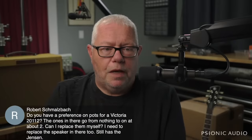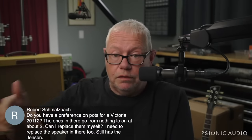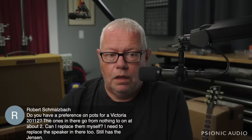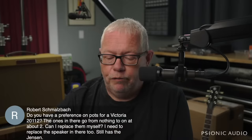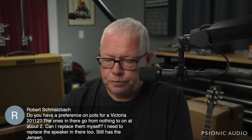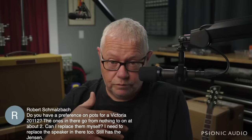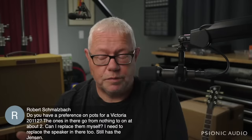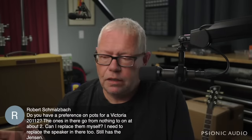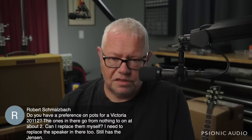Hey, Robert Schmalzbach. Yeah, in fact, I had the first video on this Victoria, the Victoria Ivy League, that I put up about a week ago. I showed that same issue from nothing, and then on. In this one, I put in Alpha 24 millimeter 3/8 inch bushing pots, 1 meg audio taper for the volume. And the Alpha does a really good job. People think the CTS is better. The Alpha functionally performs better in my experience. And if it fails, it's $1.50, $2. But I've not had very many failures in them. And you can clean them just as easily as a CTS.